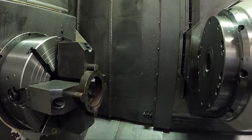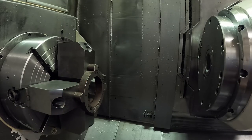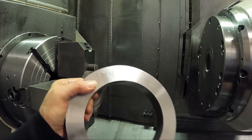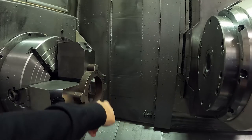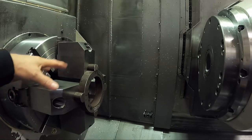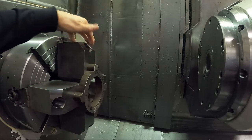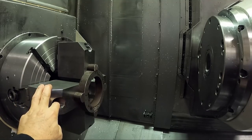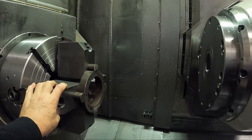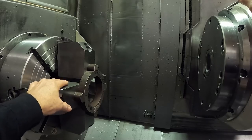This is a way to bore chuck jaws, and you can use different rings - I have different sizes. I have another one of these rings that's about this big, and you can have different size rings. You can put different depth flats in these rods. If the chuck jaws are cut away for clearance back at an angle, this would still work because there's enough screw hole left in here. I've done this also on three-jaw chucks - works just as good on a three-jaw chuck.